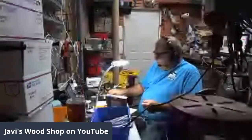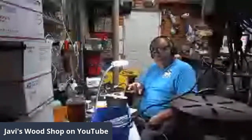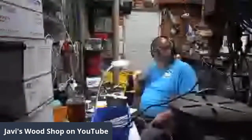For instance, like right now, I'm going to take a 3-pin controller. There are 2 sets of wires that are required for a Javi box spindle cable. This is the spindle cable that goes to the Javi box. Now, the Javi box has 2 different outputs. One of them is the 4 different outputs, output 1, 2, 3, and 4. That's one plug. The other one is the spindle controller output, which has 0 to 10 volts. So while one has a 24-volt output when you turn the spindle on, the other one has a 0 to 10-volt output for the speed.